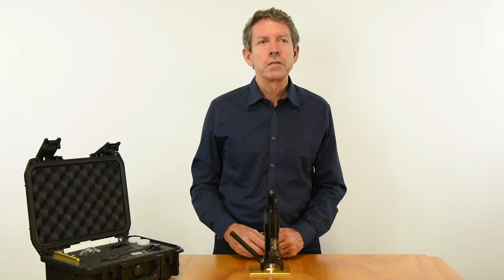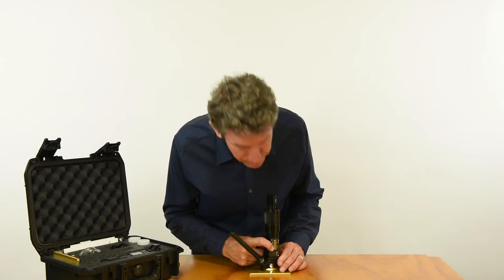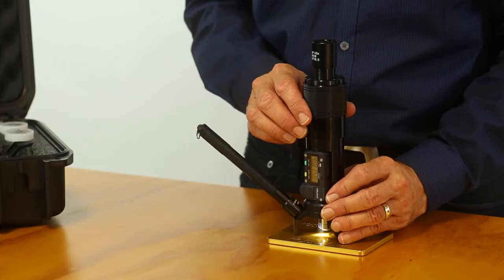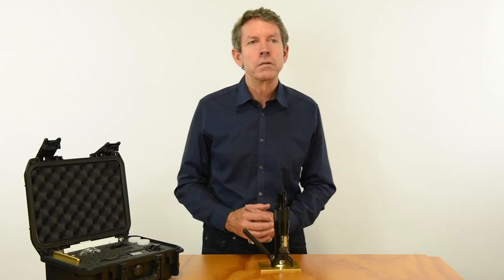Here are the same four steps on the scratch plate. Focus on the good surface next to the scratch — surface A. The scratch itself is just a blur because it's out of focus. Set zero; this becomes our reference point. Now focus down to surface B at the very bottom. Then read the number on the display. It's a good idea to repeat this one or two more times to confirm the readings are repeatable — and don't let the base move around while focusing up and down between A and B.